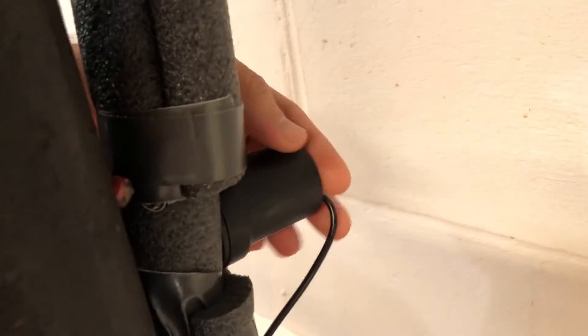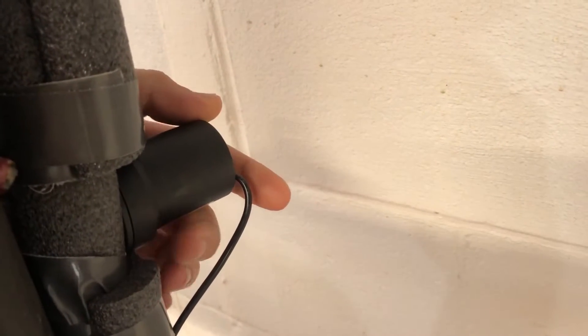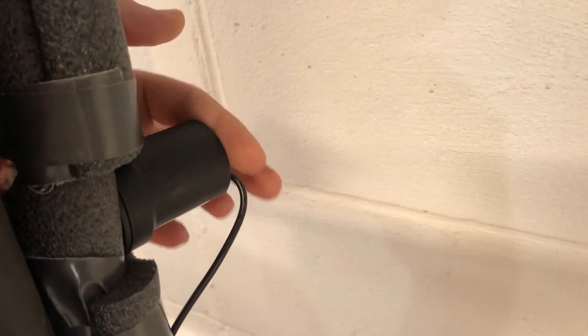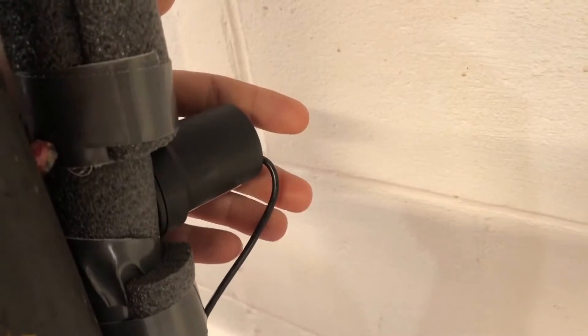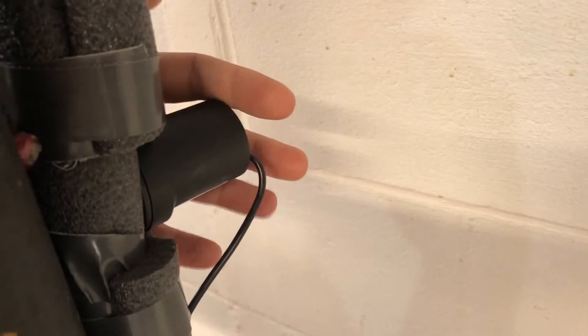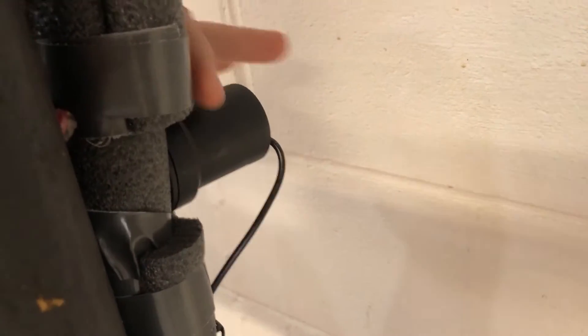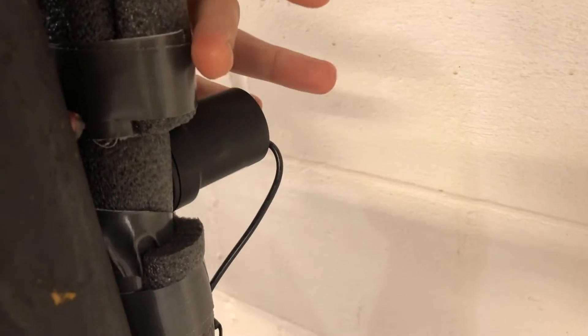I use this rack to hold the lines over to one side where I cut out a slot — that's all that's doing. This is the 12-volt pump here; it is external to the chest freezer. You could use an aquarium pump and put it directly in the chest freezer without using a check valve, but I wouldn't recommend that because it's going to warm up the water in the chest freezer and reduce efficiency. It's better to keep the pump external, where its heat is expelled into the air and not transferred into the fluid.